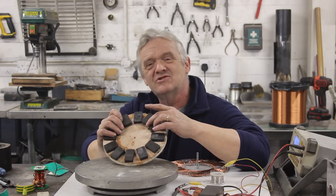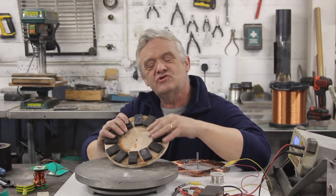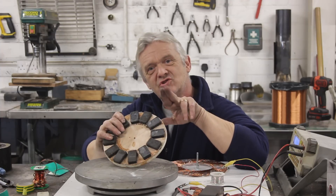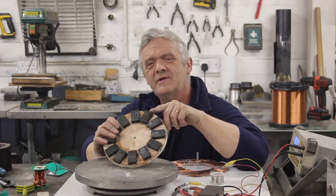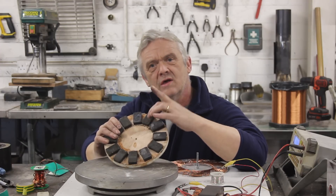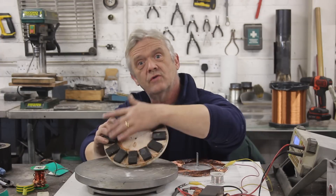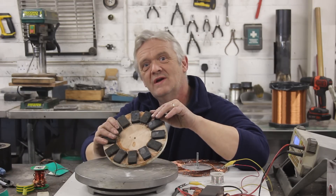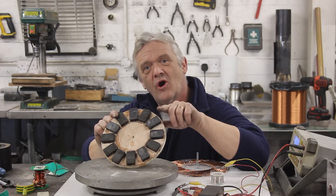Of course, if we carried on and filled that entire gap, that creates a problem. The problem is that magnetically they are 180 degrees apart, so they'll cancel each other. What you do is when you finish winding that section, you start a new piece of wire and continue winding your coil. You'll have two bits of wire sticking out at one end and another two bits at the other end — four bits total. You start your first winding here, follow the pattern all the way around, bring that piece of wire out, get a new piece of wire, and carry on filling it. You've got your single coil but you've effectively center-tapped it.